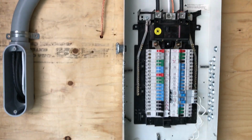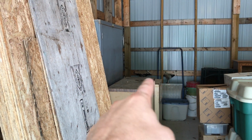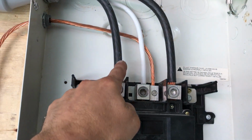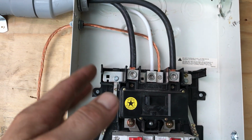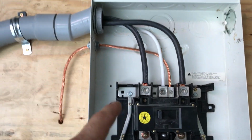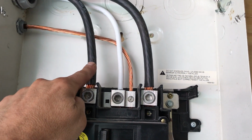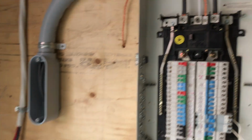All right. Same thing with the ground wire. You start from here, you fish it to over there, and you leave the excess over there, because this stuff is very expensive. So you don't just want to start cutting pieces right off the hop and then you realize, oh, well, I cut it 6 inches too long. Oh, don't worry about it. No, you do need to worry about it. You leave the excess up top because these are all pre-measured and pre-cut and pre-ordered pieces of copper. So, you know, all the measurements were pretty darn close. There's no excess on the floor here. Any excess wire is hanging out of the mast outside.